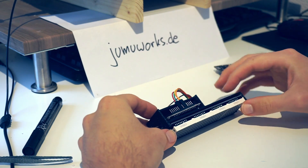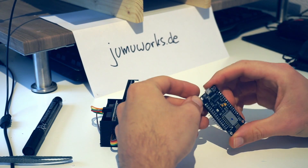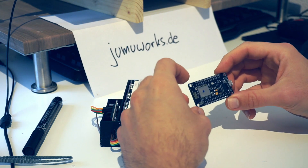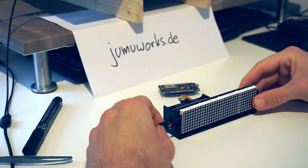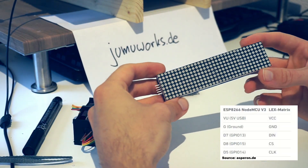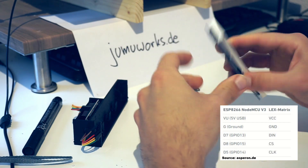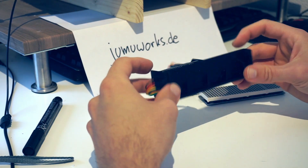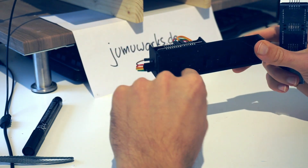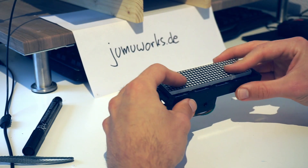The slider consists of mainly two parts. The heart of it is this ESP8266 microcontroller and you get it for something between 2 and 5 euros or dollars. The second part you need are these LED panels, which come already connected as one piece. And the third part is this case — a 3D printed case I designed. Because of this PETG case and these small pillars, it's possible to just stick it inside.